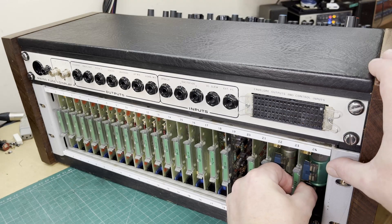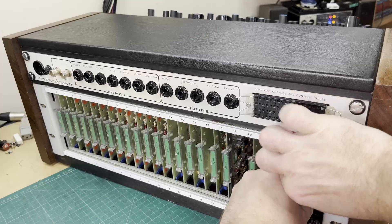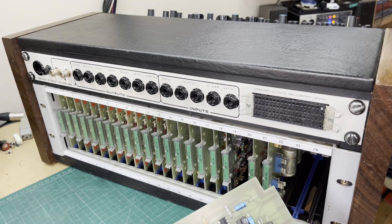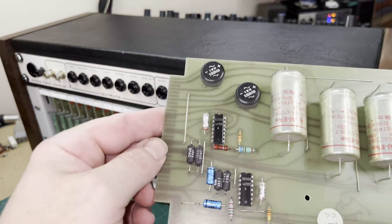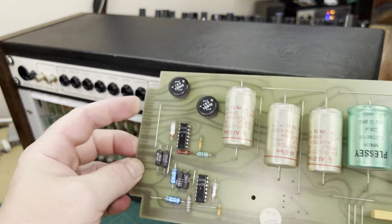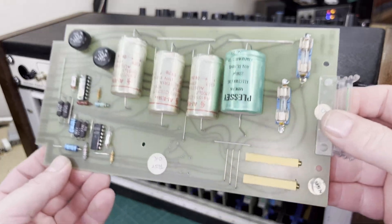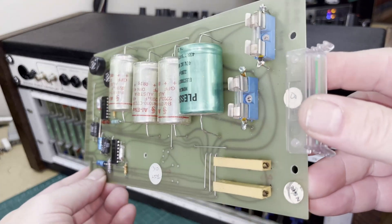I notice that these two boards here are power supply boards. Let's just have a quick look - it's in quite tight. There we go. We have quite a simple little power board here. It's built around some UA723 voltage regulator chips and they've got some bridge rectifiers here, so it looks like they must be bringing some AC in. The outputs go to the fuses, so the DC is fused, which is good to know. There's some filtering there and a couple of variable resistors, so I presume you can alter the voltage output. Very nice.